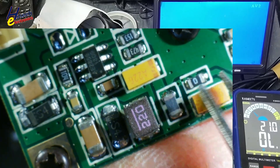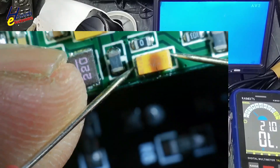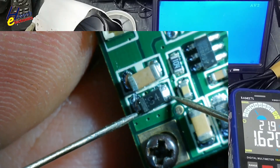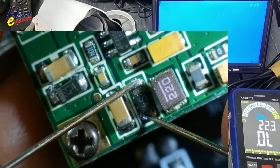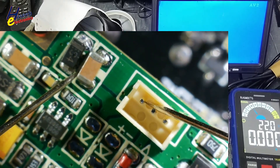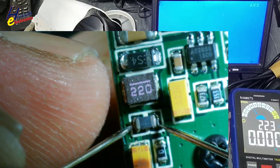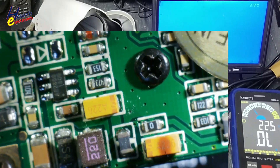Because this capacitor is damaged and is in this circuit, we need to check this one as well. Yes, this capacitor is short circuit. This diode is short circuit — it is giving 0.337V, which is not a good reading. This diode is connected at this line: this is the positive terminal, ground, and this is the video signal. Now we check these inductors and we'll first remove this capacitor.